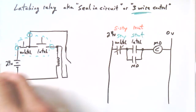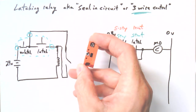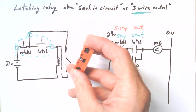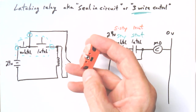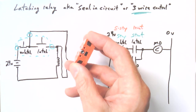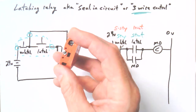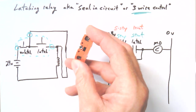You can see you've solved that problem when you use normally closed contacts for your signal to stop everything. Picture this. Picture a wire coming loose and you lost your actual wiring for your safety circuit. What would happen? Well, it's based on being broken open to stop things. So if a wire comes off, things will stop. Or another way you might look at it is things won't be able to start. So the normally closed contacts always are used for that reason.